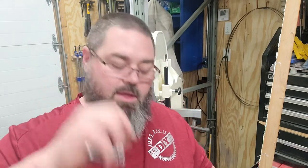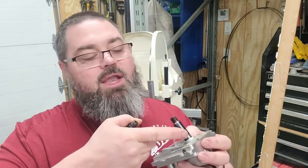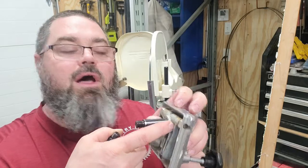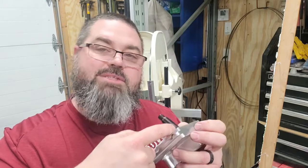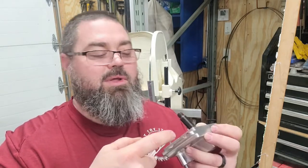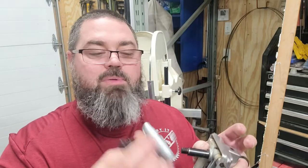I've got a Dremel with a metal blade on it. We're probably going to try and just break this ear off the rest of the way. Then we'll lay that Dremel down here and cut through right there by that collar, on that side and on this side too. That way we can get this old piece out of the way, then press out the sleeves, or that little rod, whatever you want to call it, inside of there, and then press in the new one.